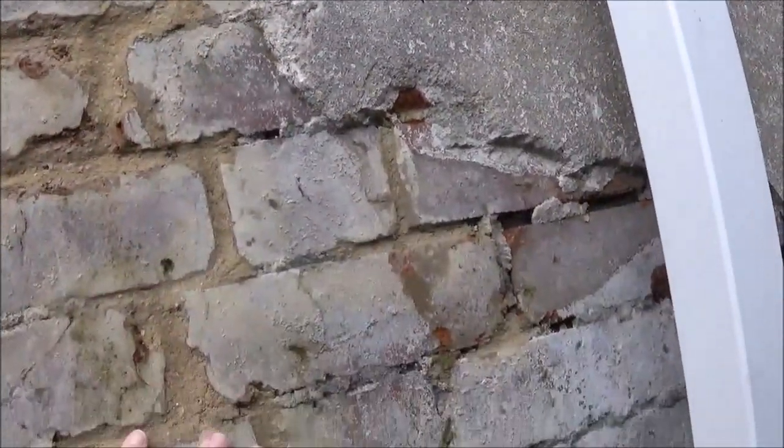Make sure that you cut the end you don't need to join to the other piece. So if you get your knife, you just want your blade along these grooves and cut out the sections you need to cut out. If you were laying this on a path with heavy foot traffic or on a driveway, then you'd have a proper sub base with hard core and stone dust. But here, for my purposes, I don't need that because this is never being walked on. So I'm literally going to compact the soil down and place my drainage on that. This isn't best practice, but this is never being walked on — it's right by my woodshed. The path's coming to here, so there's no need for that.